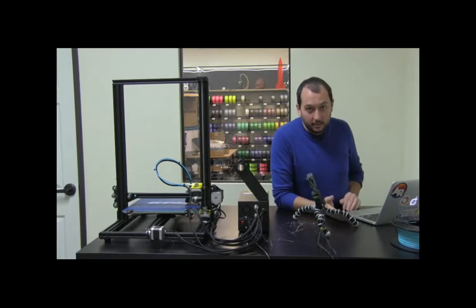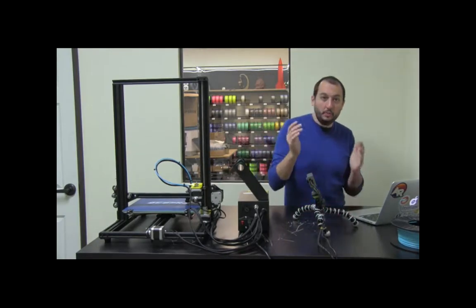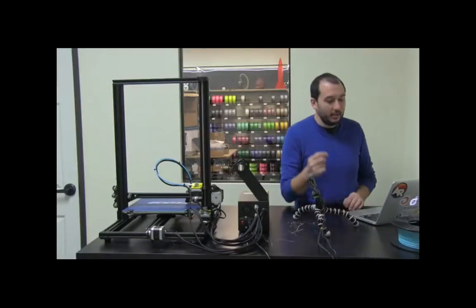So you got it all together, which is awesome. And the difference, as I mentioned, is because it's bigger, we just need to have a new Cura machine set up. And then we're also going to have to make sure that the machine itself, the integrity, is all good. And leveling is a little bit different because there's four screws. I felt that a while ago that there were four adjustments instead of three, which is kind of weird to get used to.